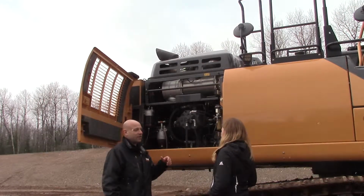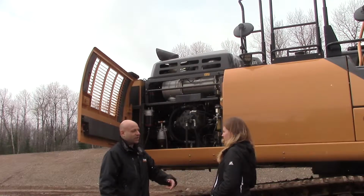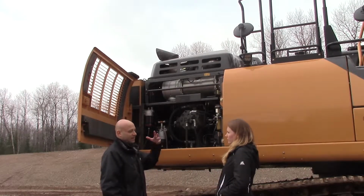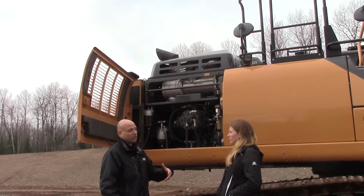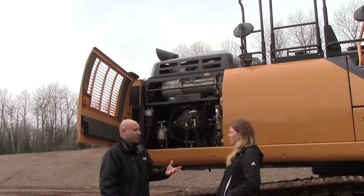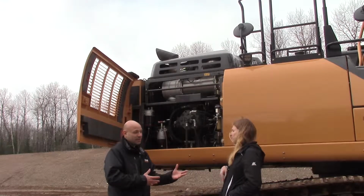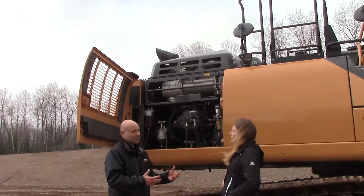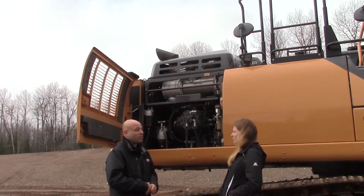The fuel savings come from the fact that you're reusing the oil in a better way. Okay, so you don't need as much RPM to get the machine flowing. Sure. The fact that you're not using the engine to rev as much RPM, you're saving fuel at the same time. So that's where we were able to not only increase the speed, but also get a fuel efficiency up to 14% on the different models or the mode you're operating at.